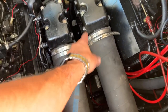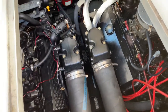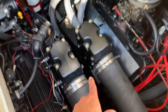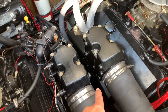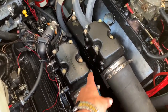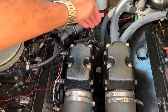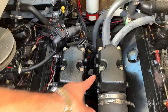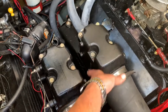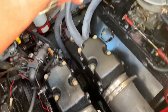So that hot salt water goes through the entire exhaust system and gets dumped out. With the full system, the block and the lower half of the exhaust get cooled by antifreeze, so the only part that sees salt water is the elbow at the top of the exhaust. On the half system, the gasket there has penetration so water comes through and gets dumped. On the full system it's blocked — the top of the exhaust is separated from the bottom half, which gets cooled with antifreeze.